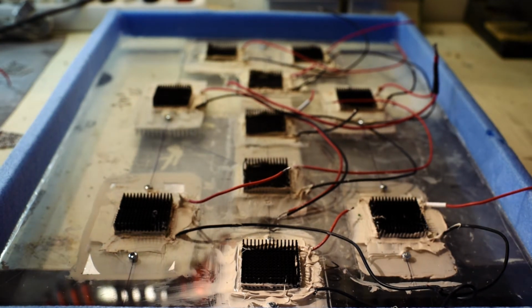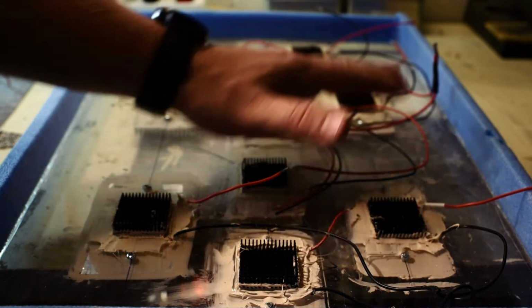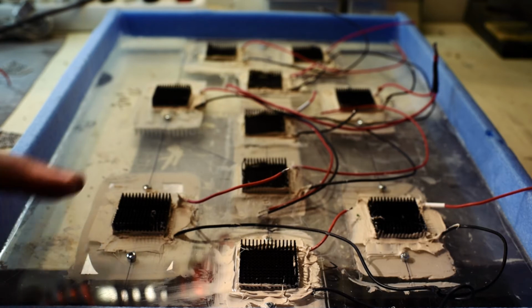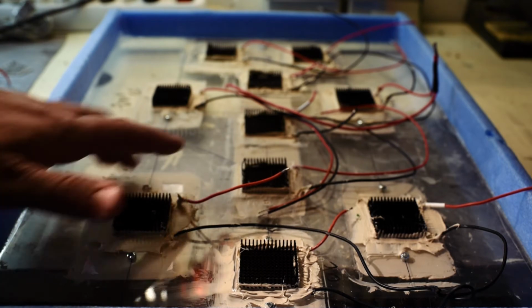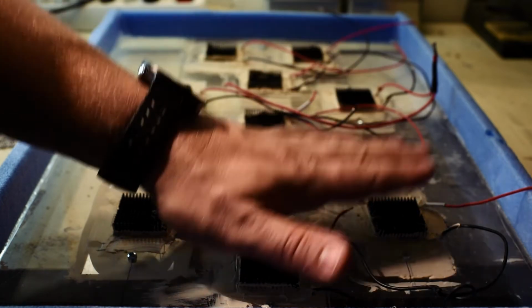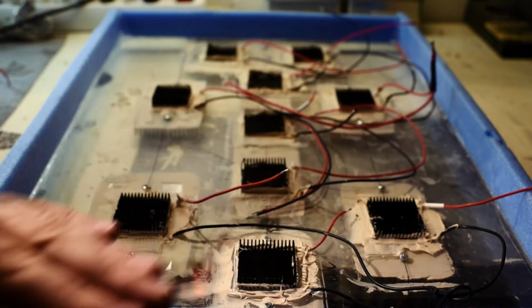So you make this area much larger, but this is the active cooling area, and these heat sinks here radiate the coolness into the surrounding water, so they dissipate their cold and they cool the water, and you would put all your drinks inside here. You stack them up inside the area. I'd say about that much water. That's why I've sealed them all off with silicone, so that the water doesn't actually get to the Peltier device. Only the heat sink is actually touching the water. All these wires will obviously be insulated as well.